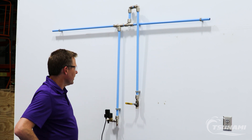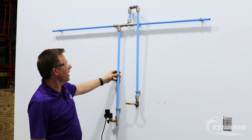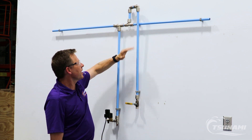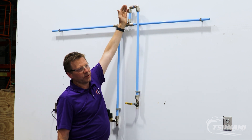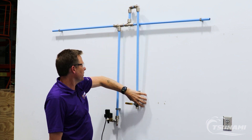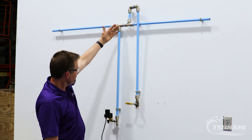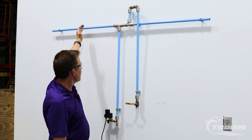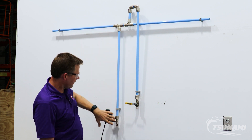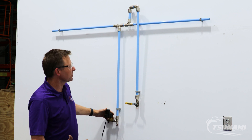One of the things I like to mention is most air systems have their drops coming straight down off of their main header piping. In a perfect world, for all your air drops, you're going to have a riser pipe where the line goes up about six inches, over, and then comes down for the air piping, and you install your filters or attach to a machine at that point. The straight legs coming down are called drip legs, and that's where you want water that's in that air piping to run down to and have it removed with a manual drain or optimally with some form of automatic drain.